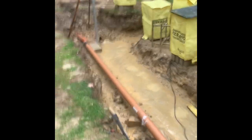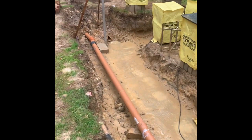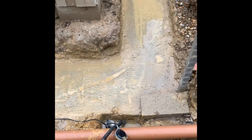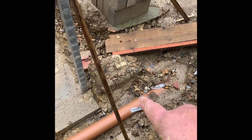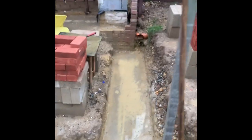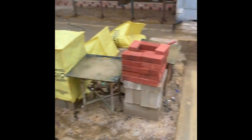Friday morning - just did operation sweep-out on the footings with the pump. Got a lot of it cleared. There's a bit of surface water on this end, going to sweep that off and move the pump over to this corner because I think there's a possible break in this rainwater pipe - water's coming down alongside the pipe and into that hole, filling the footing up. Checked all the profiles put up on Wednesday and they're all sweet.